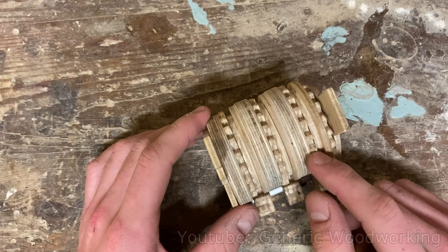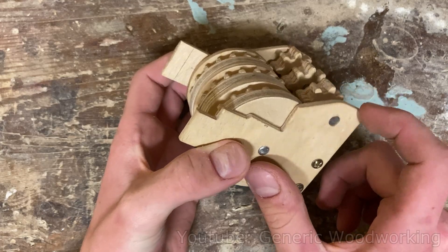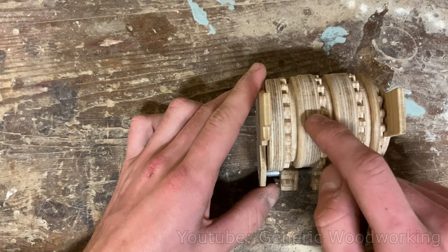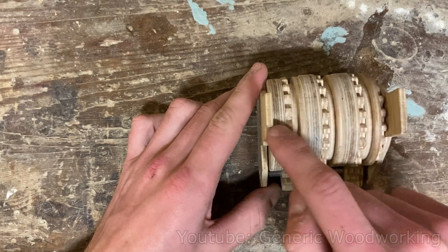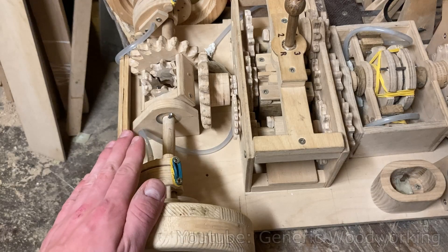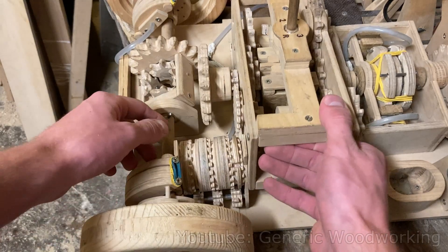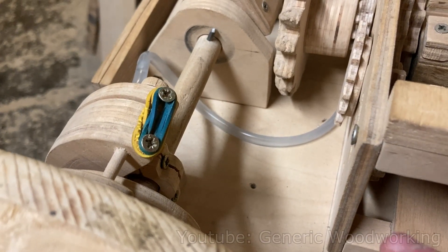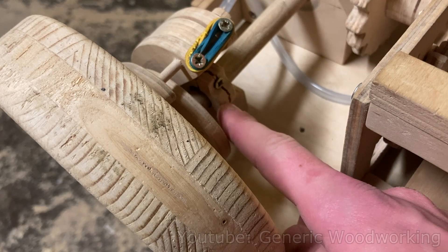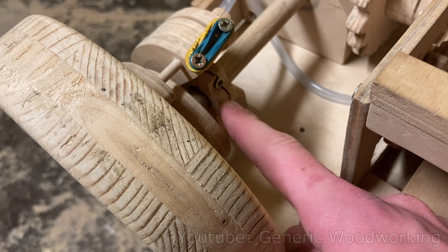One problem is that these gears aren't very precise, and because of that I had to keep the spacing between these two shafts slightly longer than recommended. Because of that, there is quite a bit of slack in the mechanism, so the numbers on the display might be a little off. One of the many realistic features of this car is that it is very cramped and there is basically no space for anything. This odometer doesn't really fit too well because it gets squeezed between the gearbox, rear axle, and the brake mount. Considering the fact that this brake mount is already cracked and needs to be replaced, I think I have a solution to kill two birds with one stone.